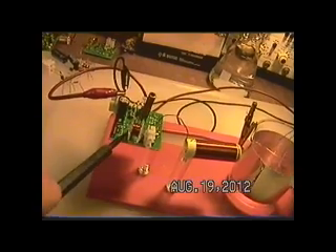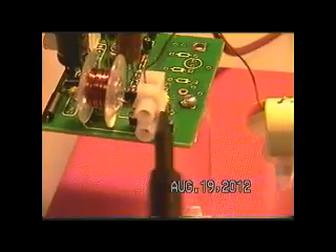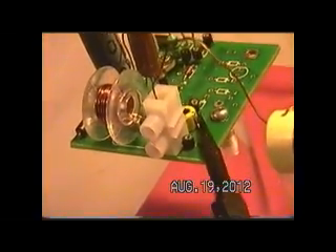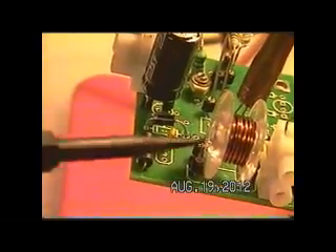This is a student-grade exciter. What that means is we have sockets on almost everything: the filter capacitor, the base resistor, a connector and some sockets, and also the addition of the tuning capacitor. That's to make it possible for changing parts and observing the effects on the board. This does not have the 10 micro-Henry choke in it — I'm using the wire bobbin for L2, a larger filter capacitor, and my base resistor is a 10 mega-ohm, not the 1 mega-ohm that comes normally on the boards.